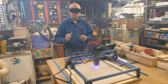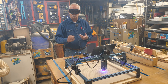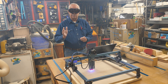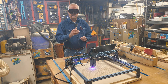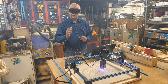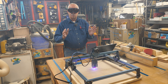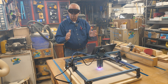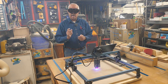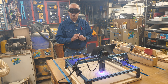The proper color for a blue diode laser is orange. I know a lot of lasers come with dark green, light green, mid green, or red glasses — that's better than nothing. But if you talk to an optometrist or look up the wavelength of a blue diode laser, the proper color is orange because the opposite of blue is orange. You definitely want to have safety glasses on. Do not operate one of these with children or pets around, because a child or a dog or a cat will want to stare at the laser beam and it will absolutely damage their eyes.